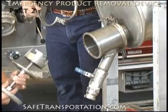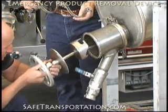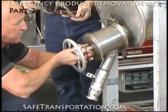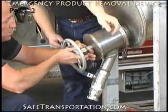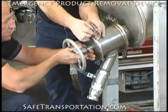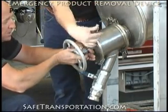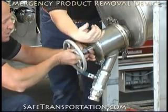Understand — this is a plunger, not a screw. What you need to do is move it in there, look up inside, keep your hands out of the way, capture the lugs, and then don't press on the valve itself — press on this little plate right here, and you'll hear it snap in place. At that point, an assistant can come in and help you finish the assembly of the valve. By tightening up this butterfly, you're compressing a little gasket up inside there to make sure there's not going to be any leaks.